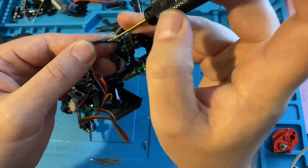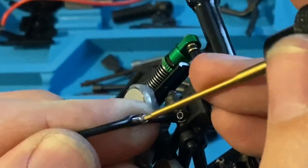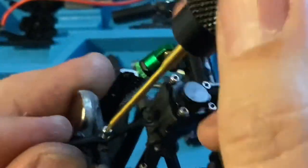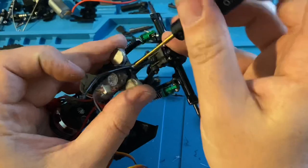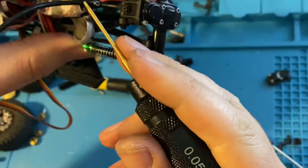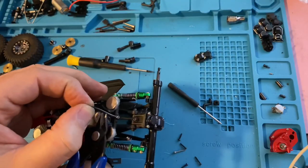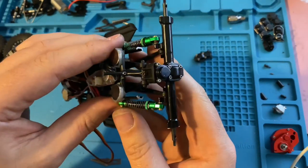Be careful when you're doing something like this — I've actually screwed a screw into my finger because you're pushing hard trying to get it through the rubber or plastic. It's always better to leave extra. When you're drilling a hole, don't drill it too big. If you're cutting a wire, don't cut it too short. Because you can always drill the hole bigger and you can always cut the wire shorter. We may have to shorten up our front actually, but yeah that looks good.